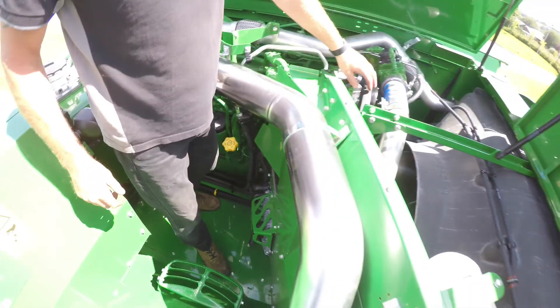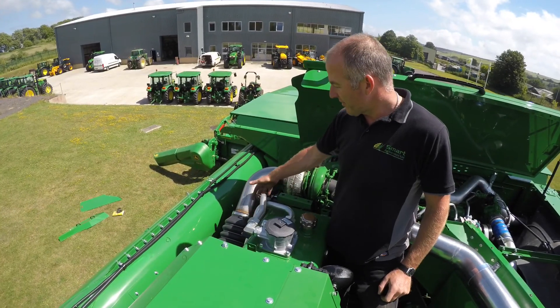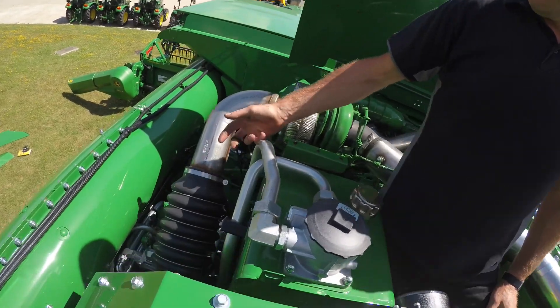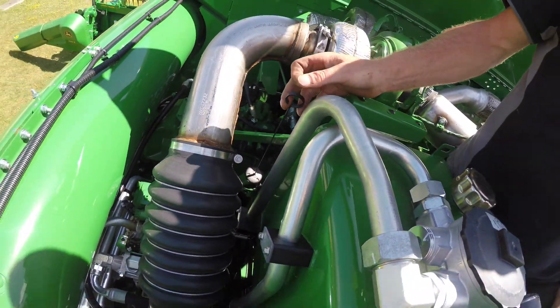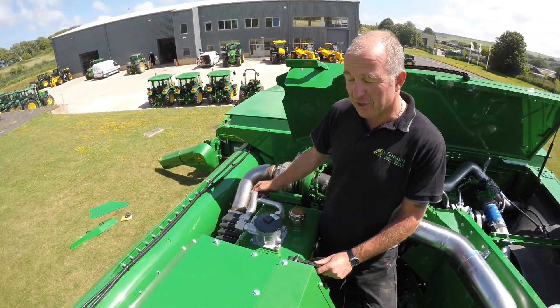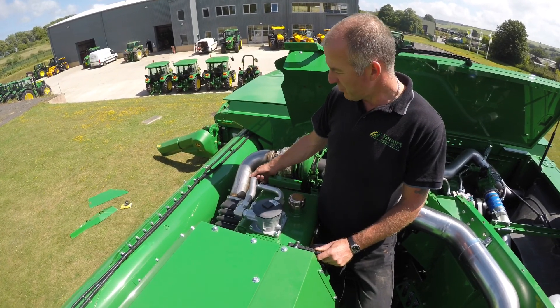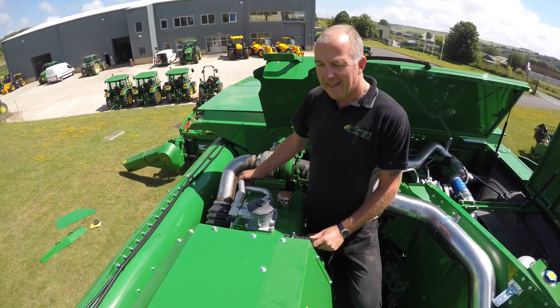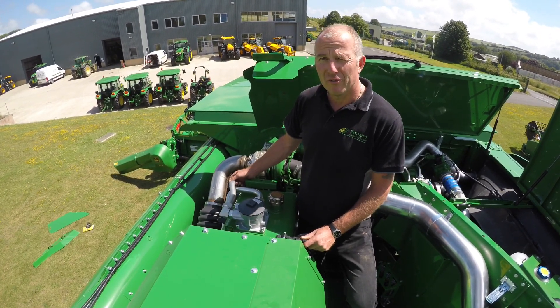All belts are self-tensioning on the fan drive. On the tail shaft gearbox, we've got the dipstick there to indicate how much oil is in the PTO gearbox. The correct way to check the pro drive transmission is to start the engine, leave it running for a minute or two, stop the engine, let things level out, and then dip the oil — that will give you the true reading.